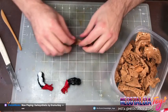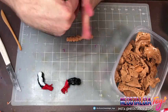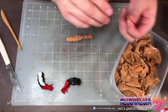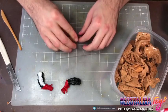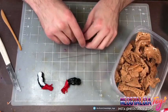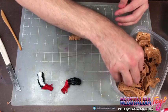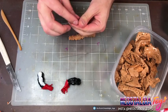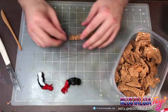Because I want it to meet the part at a 90 degree angle, not at an angle like this. It's just easier for the material flowing toward it to enter at the 90 degree angle. It's also easier for removal. You'll know exactly where your part is, and there's less to guess and reshape, because the more you tilt it, the bigger that contact point gets.